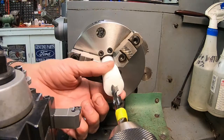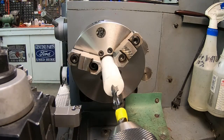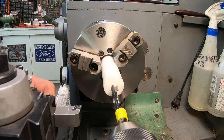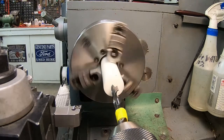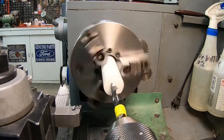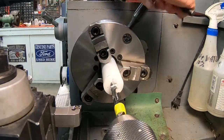All right, now we're going to make the plastic bushings. This is Delrin. It's made for this. It's a machinable plastic. So first of all, we've got to make a hole in it, and then we'll gradually go up to size. And we'll have to finish the size of the hole with a boring bar to get it exactly where it needs to be. But I can step up with two drill bits here and get things going. Pushing that a little bit.